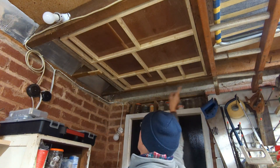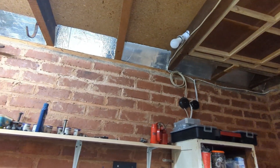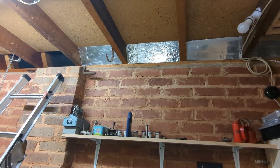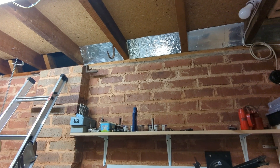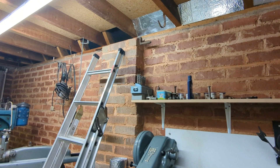I blocked up the space around here which was also open, so excessive ventilation was an issue in my workshop. I'm also filling in the eaves with foil-backed foam which I'm cutting to shape and fitting in — it's going in very easily, quite nice stuff to use. At the same time I'm also applying woodworm treatment before I cover up areas that will then be inaccessible. I'm leaving the heater on and we'll see as I work through the day if the temperature comes up as I put a little bit of heat — it's only one kilowatt — into the workshop.